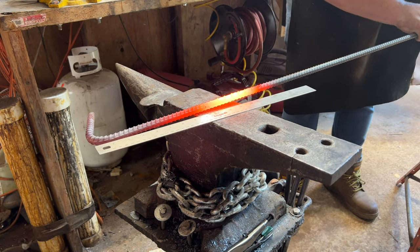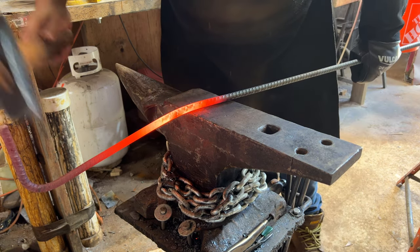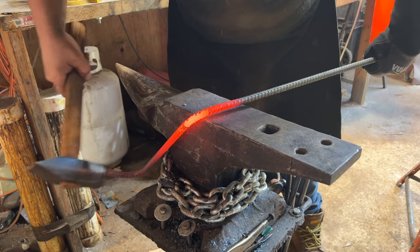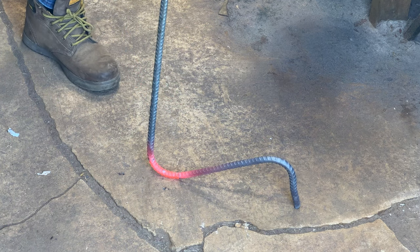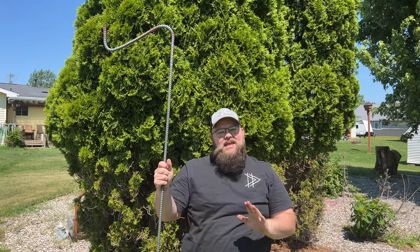Just like before, I'm measuring it out on my ruler to get that 12-inch mark, then I find my bend and hit it on the cooler part of the steel. With this bend, we are not looking to get it to the final dimension yet — you're still going to need a little more bend in a minute. What you're trying to do is get to that 90-degree angle. While you still have a little bit of heat, you can finish the bend right down here on the ground. Who says you need to do all of your forging with your hammer and anvil anyway? These shepherd's hooks stand about seven feet tall, but once you knock them two feet into the ground for stability, they'll stand right at that five feet where my customer wants them.